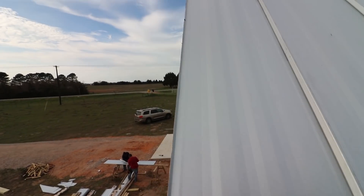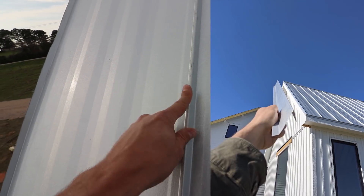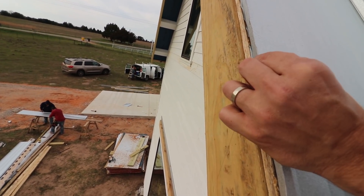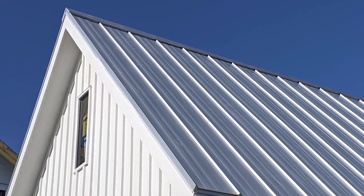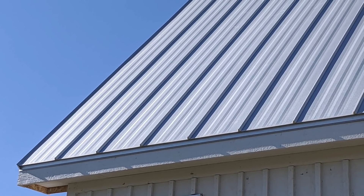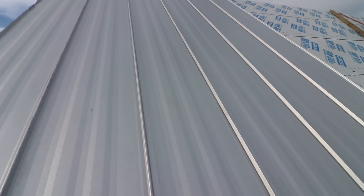The other feature here is at the end of the roof — we are currently just using these little clippy tie-downs holding this down. We bend the edge of the roof up, and then the trim — we don't have it in yet — will match this on the top. It will come down off the side about three inches, covering this and looking just like a rib, then come down off the edge. It's going to make it all look the same, like you have a rib that starts all the way out. I don't like the aesthetics of bigger boxes that are sometimes used, so having just another rib start on that side and repeat across the 16 inches looks the best.